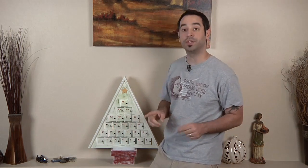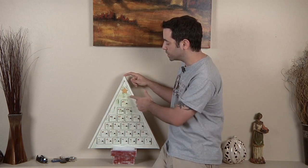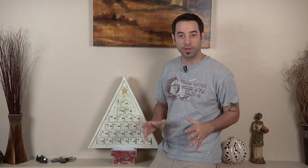The other thing I'll mention is the painting. Be very careful when you're sanding these multiple layers of color. When you sand into that base coat, for instance, I sanded through the white and exposed this green. If I don't get all that green dust up and then you hit it with a water-based finish afterwards, it sort of reactivates the color and the color winds up spreading over the surface like a stain. And I did get a little bit of that on the top here, and it kind of looks a little bit like a grass stain.